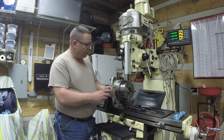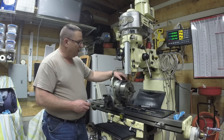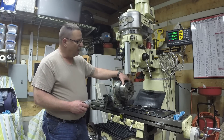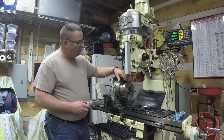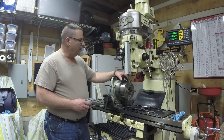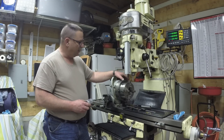I've got my rotary indexing installed on my rotary table — it's an 8-inch rotary table with an indexing attachment, so that kind of plays two roles. I also have a four-jaw scrolling chuck, meaning all four jaws move in and out together. They're in sync — they're not independent like most four-jaw chucks are. It's a 6-inch chuck on the 8-inch rotary table.